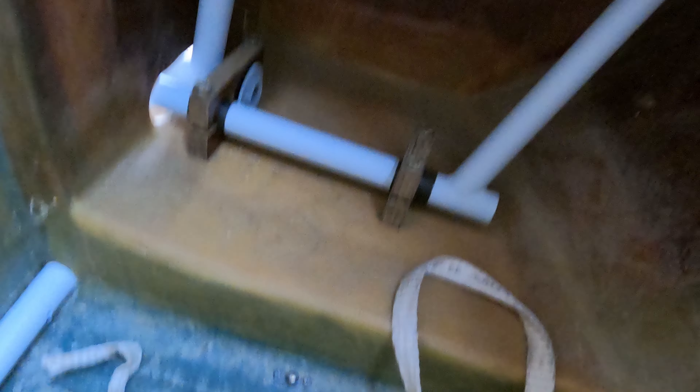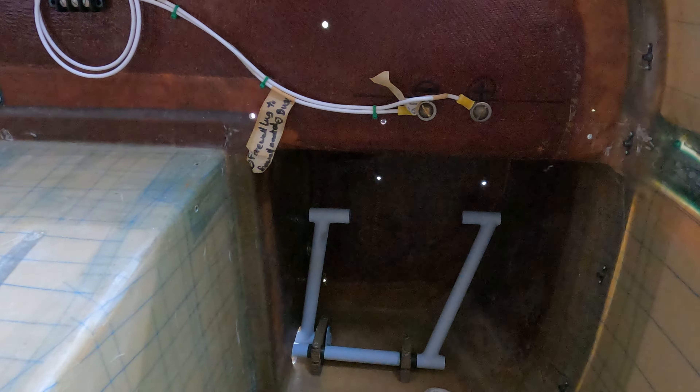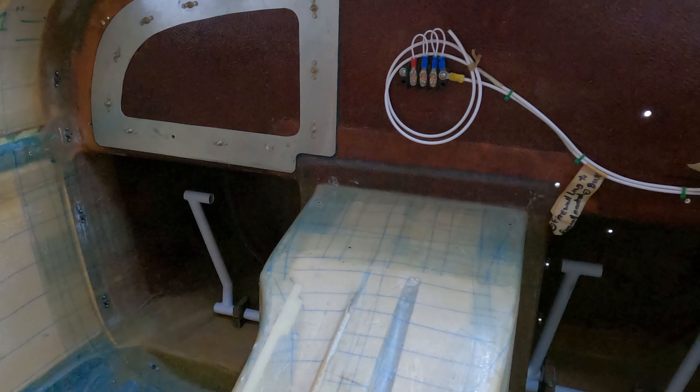Here's the view from the inside. The rudder pedals are there — you can see the phenolic board. They get screwed into a couple of nut plates underneath that fiberglass in a piece of plywood that was done many moons ago. That's the other side, the pilot side, so as I move one you see how it will move the other. Whatever control inputs the pilot does, the co-pilot will feel, and vice versa. It's always nice to have dual controls in an airplane.